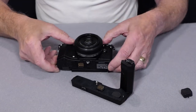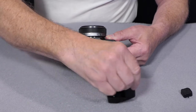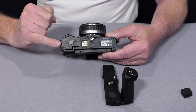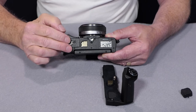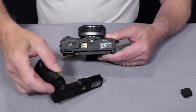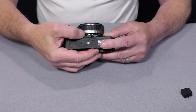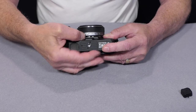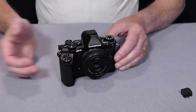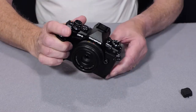The grip is fastened by a standard quarter-20 screw to the tripod socket. There is a pin on the base of the grip that aligns with the hole adjacent to the battery box. Note that when the grip is fitted you won't have access to the battery box, but it's a simple matter to remove the grip to change the battery. Align the pins to the detent in the camera base, then turn the knurl wheel clockwise to drive the quarter-20 screw in. Once fully tightened, you've got a sturdy additional finger grip that mates with your thumb grip.